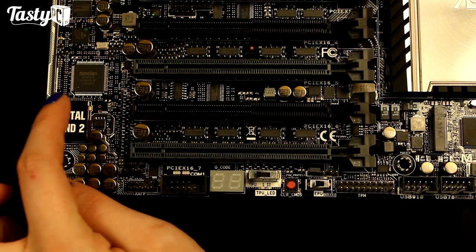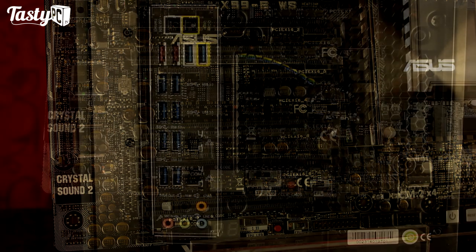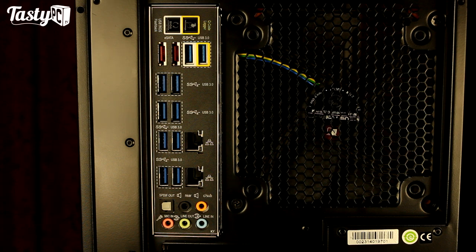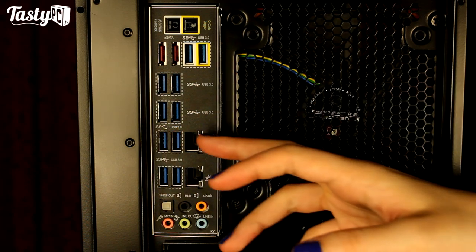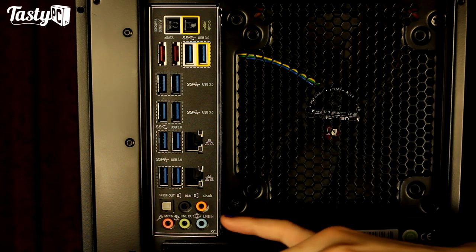We've got the separated Crystal Sound 2 audio section, which is the same as what we've seen on the Z97 ASUS boards, and still features a Realtek ALC 1150 codec. Finally, we've got the rear IO, which consists of 10 USB ports, four of which are ASMedia. One is for the USB BIOS Flashback feature — the button is here — where you can flash the BIOS with a USB stick. This one is for the Q-code logger, and if you leave a USB stick in and hold the button down for a few seconds, it will keep a log of your Q-codes, which could help with diagnosing your PC if it's having issues. We've then got two eSATA ports and two Intel Gigabit LAN ports, which are completely Intel from the controller to the links between them. I'm a bit disappointed we're not seeing 10 Gigabit on an X99 board, but you do have plenty of PCIe lanes for a networking card, and it keeps the price of the board down. We've also got an optical out and the audio ports.